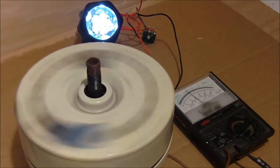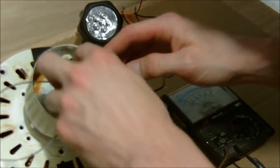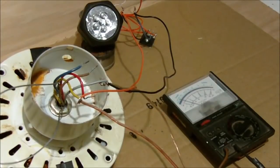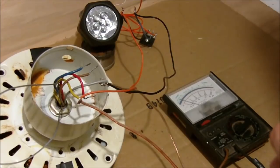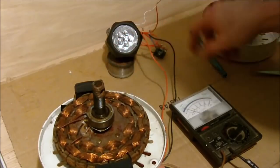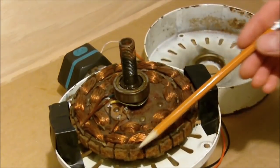This is just an example of how to do it and it's really easy. For the wiring, I've just gone through the wiring here — there's a whole bunch of wires and also a capacitor. I've only used two of the wires that I got the greatest amount of wattage out of, probably out of that first large coil. You could go through the wires and try to wire it differently to get a higher wattage. This one is optimal because it's already a low RPM motor, so it doesn't have to spin very fast to produce a voltage.